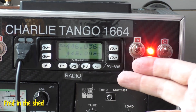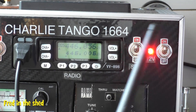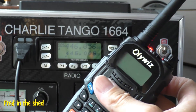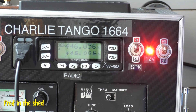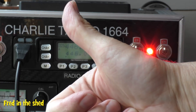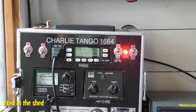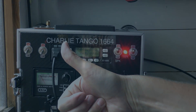Pretty pleased with that. It shows the antenna's working — we shot down to just four watts and Dave was really struggling. With the handheld on five watts Dave couldn't get me at all, which is what you'd expect. Overall I think it's a thumbs up for that antenna — it's working really well. If you can get it up high, and bearing in mind I'm only just above the shed roof — if you get it a little bit higher still it would be even better. Cheers for that, thanks for tuning in — just a short muck-about video. Stay safe and I'll catch you all on the next one.